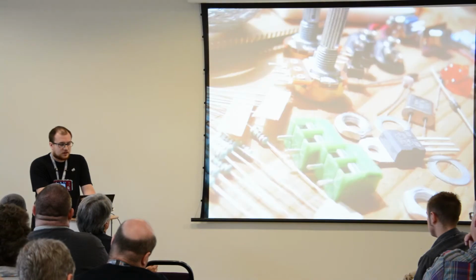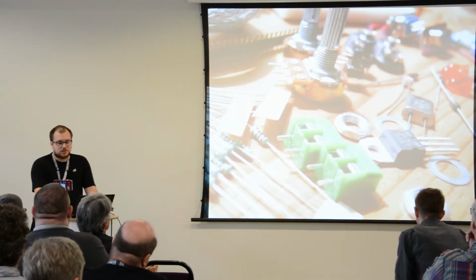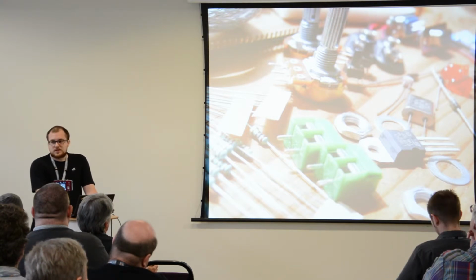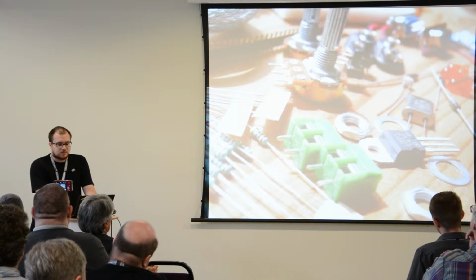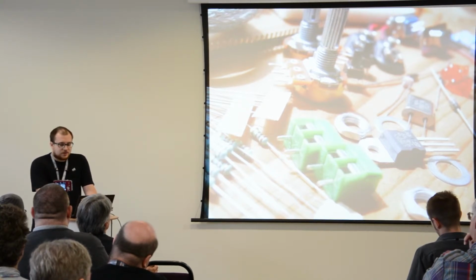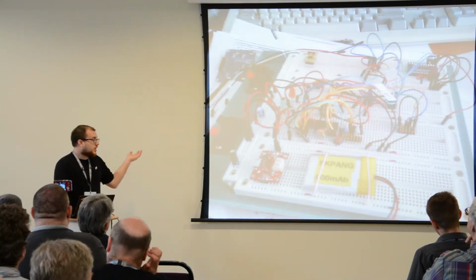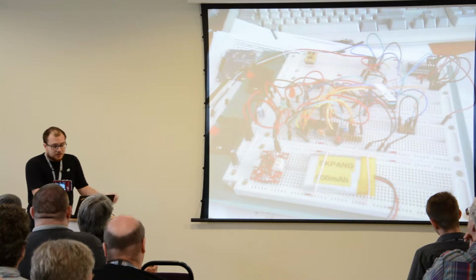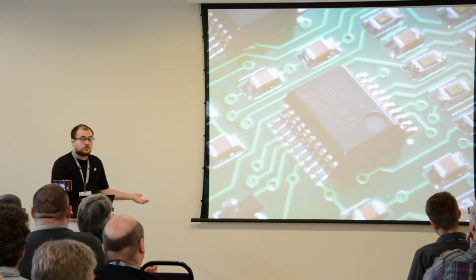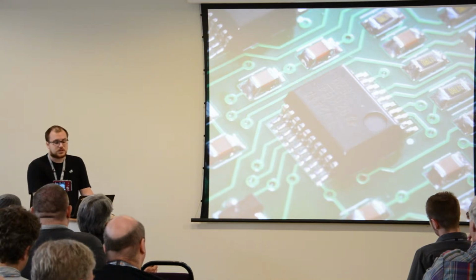Another thing is, when you're, again, tinkering, you just grab available stuff from your junk bins, or odd components left over from another project, something like that. This doesn't go very well with manufacturing. So, dumping things on a breadboard is great for prototyping, but ideally you should be utilizing surface mount technology, which can be automated very nicely using some pretty awesome robots called pick and place machines.